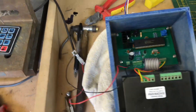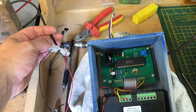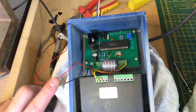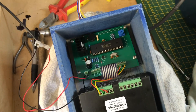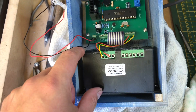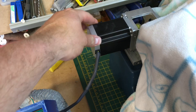You also need to purchase a stepper driver — not the most expensive, but I've used one in my other machine for about 10 years with no problems. Then you'll need a stepper motor, and finally a power supply. I'm using a laptop power supply here. Check the manual for the voltage range. You'll need to match the current with your stepper driver. The divider board is about 45 pounds; the fancy keypad is about 15 pounds; the stepper driver around 40-60 pounds or up to 100+ for a really good one; and a decent stepper motor around 35 pounds.